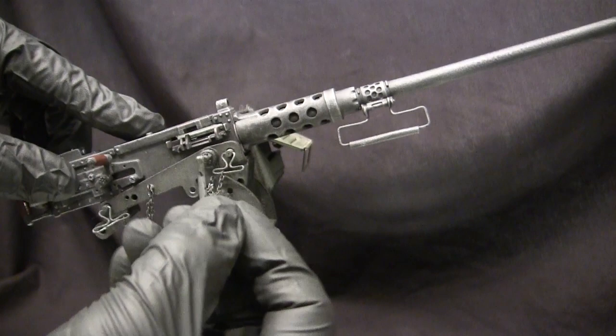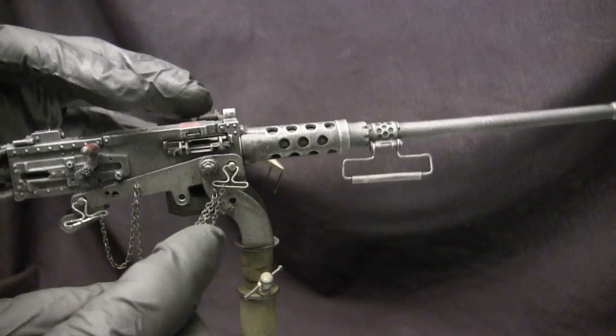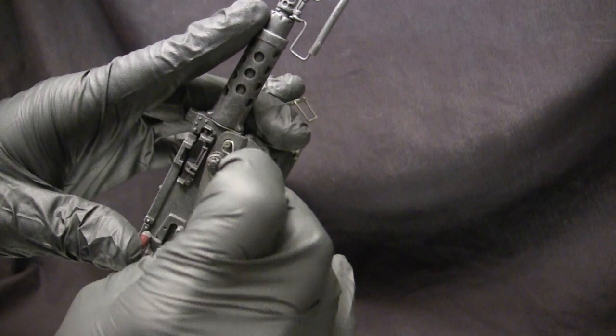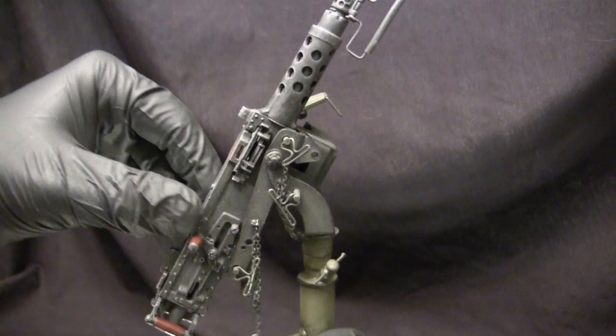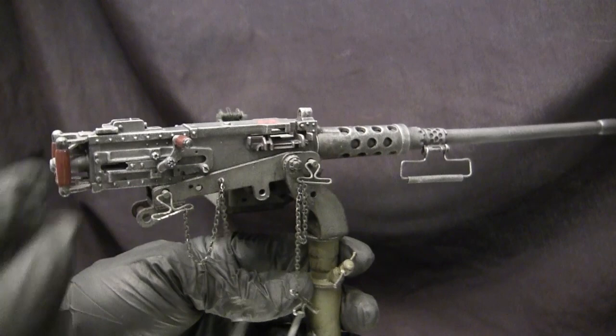If you'll notice on the Cradle, there's a second set of lugs right over here, as well as there's a corresponding hole found right here on the yoke. The way it works is that the unit would pivot into this section, and then the pin would slide in, and once fully installed, it secures the unit in place and it locks it in the upward position that we have here. Obviously, when it comes time for usage, you would pull this out, and the unit can then freely pivot and elevate like it was able to do before.